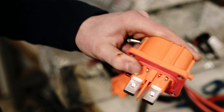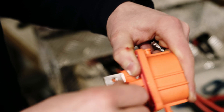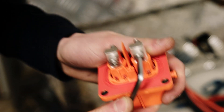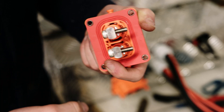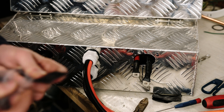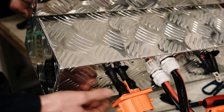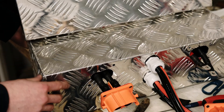The way we're connecting these connectors that come from the battery — it's obviously really important that they are connected properly. So using these M6 bolts, we thread them through the positive and negative terminals like so. We thread them all the way through and tighten them so they sit properly. Once we've pulled them through and tightened them, we shorten them off just a bit with a grinder so they don't stick out too far — we don't want excess metal hanging around. We then take our leads, push them through, get locked nuts on the back, and put heat shrink — this really fat stuff — all the way up over the connector. That gives us a really nice, solid connection so nothing should ever move, short, or cause any problems. That's how we're making these beefy bus connectors.